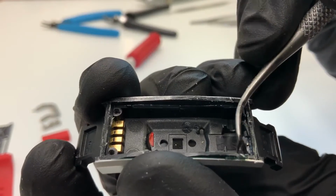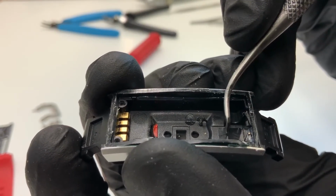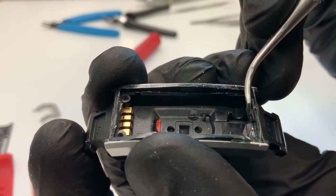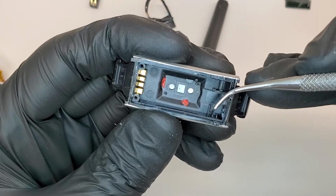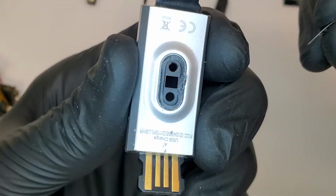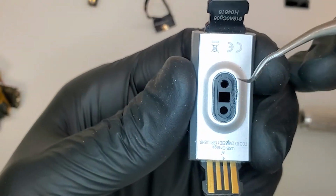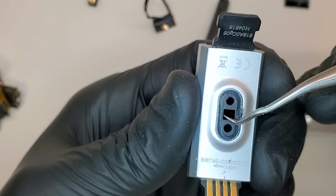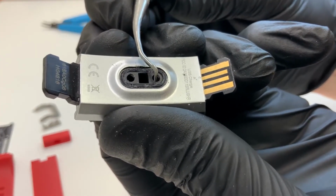This rectangular feature is a vestige from a slide that pulls steel out from under this tab and allows it to be removed from the mold. These are ribs. Look like they're designed appropriately, roughly half the wall thickness of the part. Look close there, you'll see an adhesive tape. It's a ring. This is a ring of adhesive tape right here. This is an adhesive tape that's holding that lens in place.